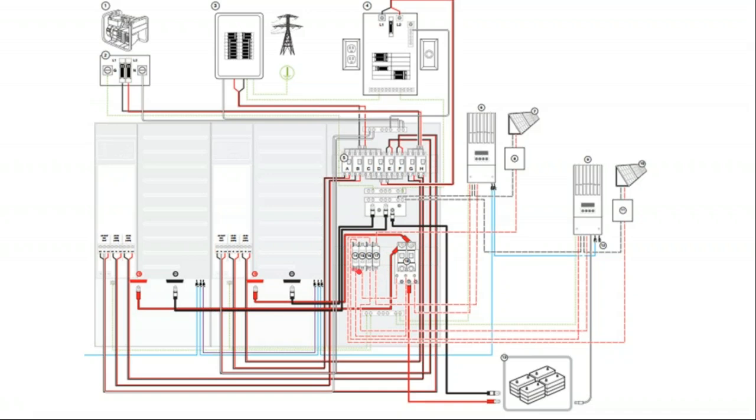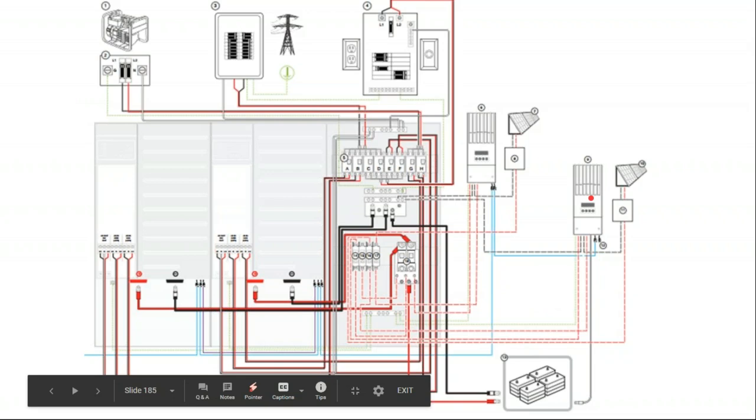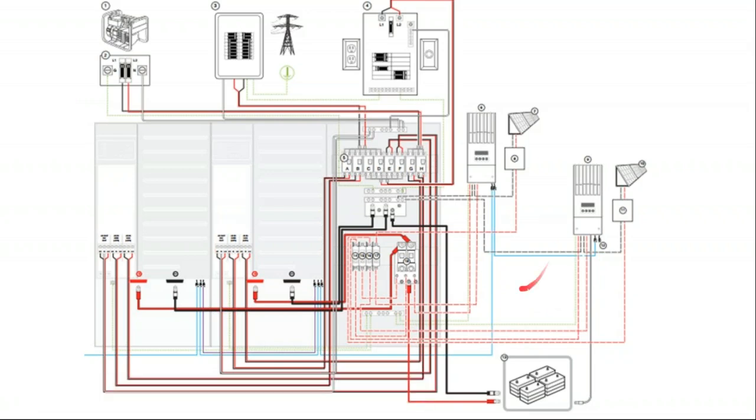So this side on these breakers, these are actually 600 volt DC breakers taking the power from the solar array and putting on some overcurrent protection and switching so that you can power down the charge controller if you need to service the charge controller. And so these are 600 volt DC breakers at low amperage, and then the power is converted into 48 volt power at high amperage. And so we see little small wires going into these smaller breakers because the amperage is less, so the wire gauge is thinner. And then we have these larger breakers because the amperage is higher.